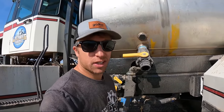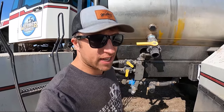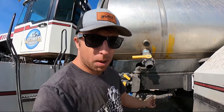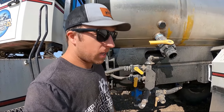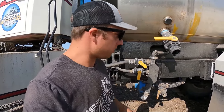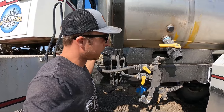It had a nice three-inch port so I went ahead and put a three-inch valve on it - three inches is the way to go, two inches takes forever. I still have a two-inch down here just in case, and it's the lowest point of the tank so I can drain it or pump it somewhere else. Same pump, same location. I reduced down to two valves - we had four originally but there was no need, so less things to go wrong. This is agitation, or sparge.